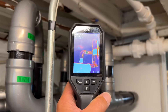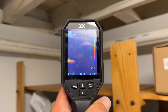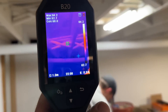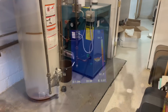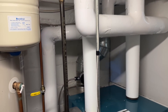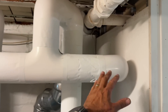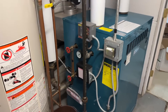If you take a look at our steam piping — 213 degrees right there — and here is the light fixture, it hasn't traveled that far yet. All things considered, we have this boiler that was installed in 2008 and we gave her a new life. We're going to have nice dry steam coming up out of both double drop headers, coming back around to pick up the steam main and back around to the Hartford loop and equalizer. Beautiful job.